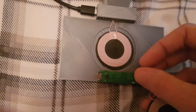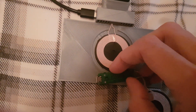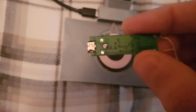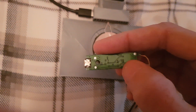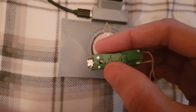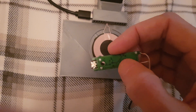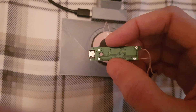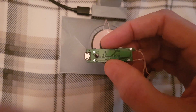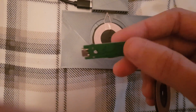You've got your two heat sinks on this side. You do want the anodized ones because you don't want any chance of shorting on those connector pads — it shouldn't, but there is that potential. So use some thermal compound — the kind that hardens up and keeps the heat sinks on. Failing that you could use superglue, which is what I've done on this one. If you want to cheat, just use some superglue.